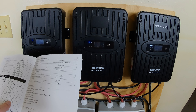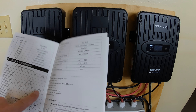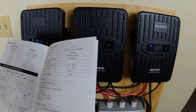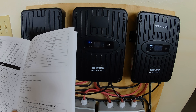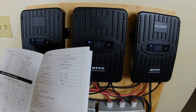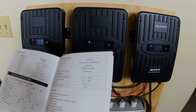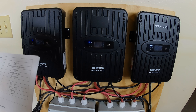These are 60 amps, so you can go to 30 amps on your load. They make different sizes — I bought the 60s. They also have 40s, 30s, 40s, 50s, and 60s. But for the price difference between 40 and 60s, you might as well buy the 60s. That way you've got some extra headroom — you don't want to run everything at max and it'll run longer that way.